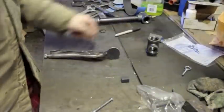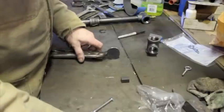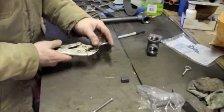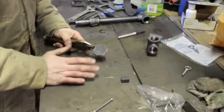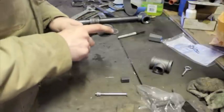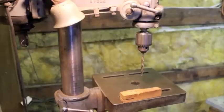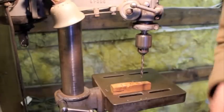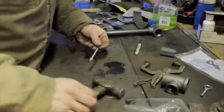I've got all four flap shapes roughed out. After clamping and grinding all four together for final shaping, they're all the same shape. I center-punched and drilled a quarter-inch hole in each one.